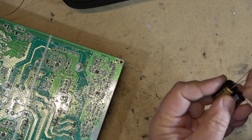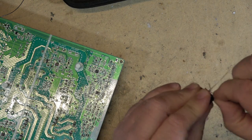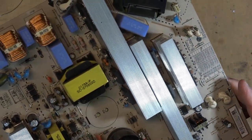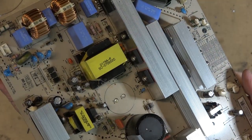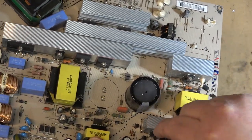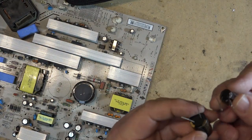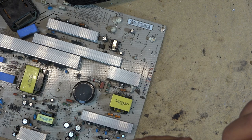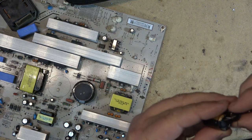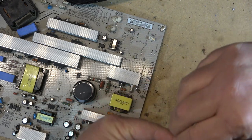We'll connect these two together — positive around positive and negative around negative — and solder them together. I need to make sure I've got room on the board, which I should. I've got plenty of room here, mounted with the other cap sitting over to the side. Just going to make sure I'm putting it in the right way. Good thing I checked that — I've got to put it on the other side, otherwise Houston we will have a problem. If you're going to be mounting caps together, always make sure you've got the clearance before you commit to soldering the leads on.